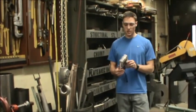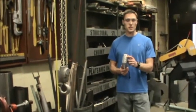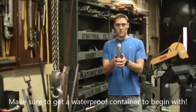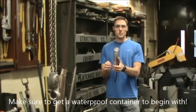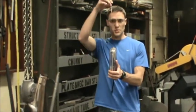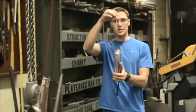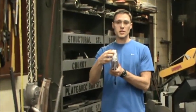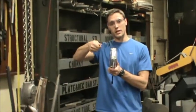In order to drill the hole for the pressure transducer, it's pretty easy. All you have to do is take this box, mount it in a vise so it's vertical, then use a drill or drill press. Start with a small hole, then get a slightly larger drill bit — larger hole, larger hole, larger hole — until you get one that's big enough for the pressure transducer to thread into.